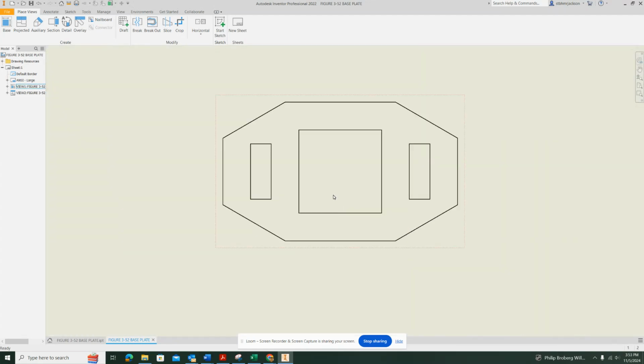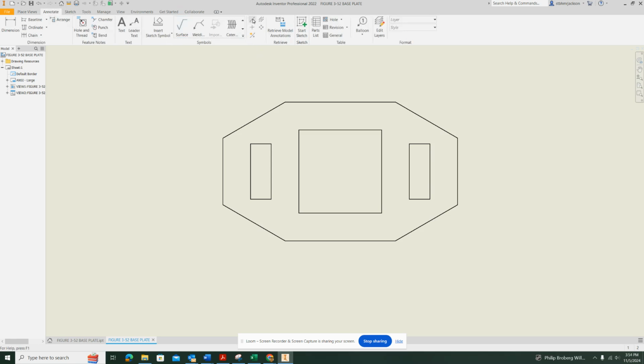All right, so now on the actual drawing, it does have a couple of center lines running down through it, but technically you don't necessarily need them, only for dimensioning purposes. So I'm going to go ahead and put them. In fact, I'm going to use centerline bisector. And it's going to make it easier to place these. I don't have to stretch them all the way out, but far enough. All right, so that'll give us our center lines that we need.